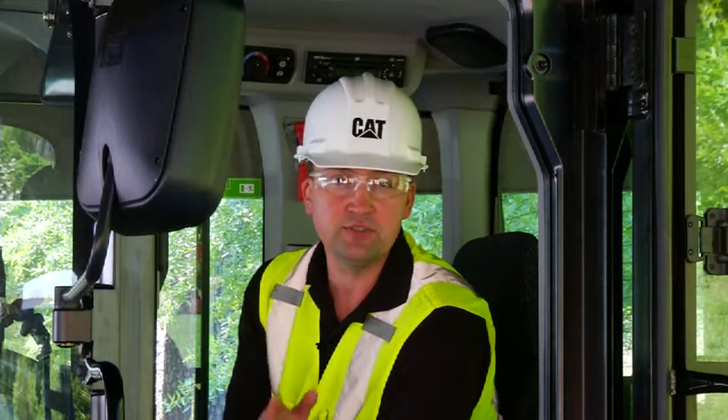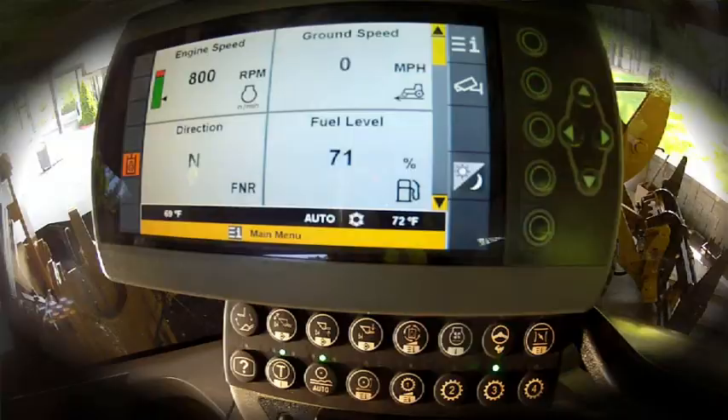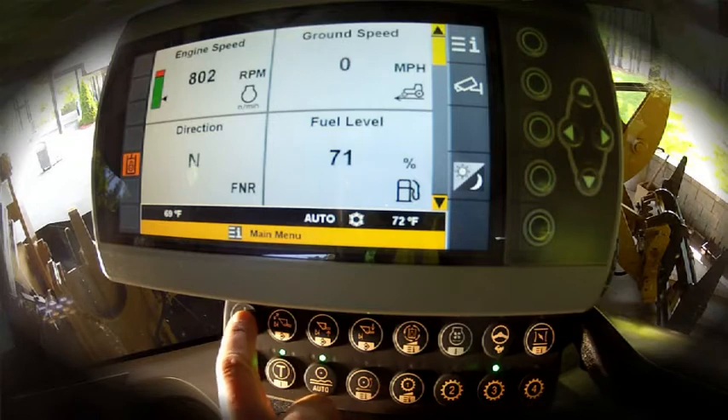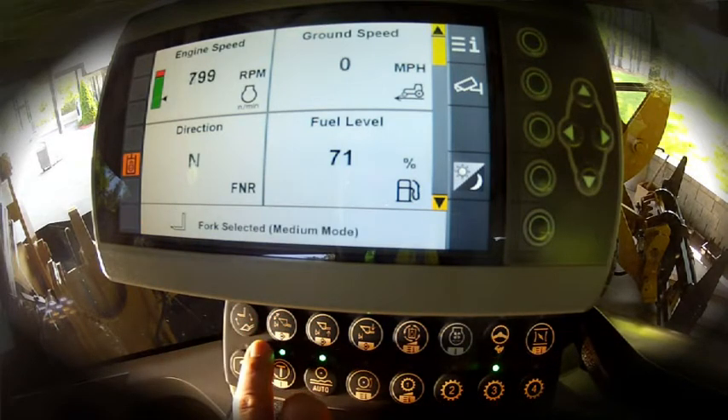True electro-hydraulic controls have been baked into the design of the new CAT K-Series Small Wheel Loader. That delivers value-adding features to you like in-cab programmable kickouts. They're easily set through the soft touch membrane. All we've got to do is put the linkage in the position that we want, tell the machine which tool we've got on, whether that be bucket or whether that be fork.